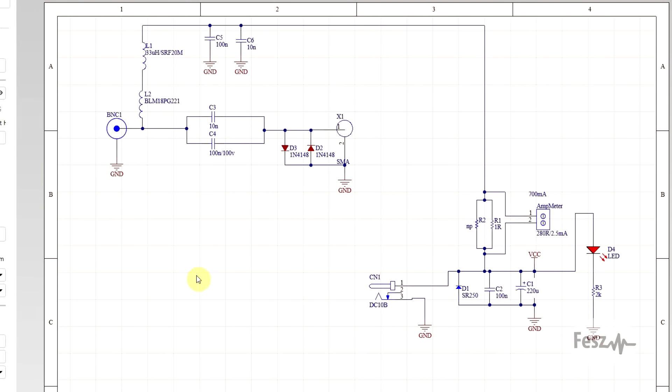The first project I needed a BIAS-T for was the vacuum tube antenna amplifier. This needs a bit more power than the average SDR can provide — about 12V at 1A. So, the first BIAS-T that I worked on was as follows. For the inductor, I used a relatively large 33 microhenry toroid inductor with a ferrite bead in series. For the capacitor, I left both a large film through-hole component as well as a small ceramic in parallel. Since this BIAS-T was supposed to work down to the AM band, both the capacitor and the inductor need to be of relatively large value. Other than the core LC circuit, I added a set of decoupling capacitors to improve isolation.